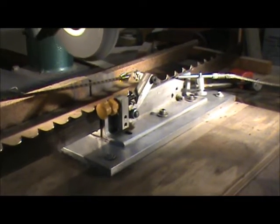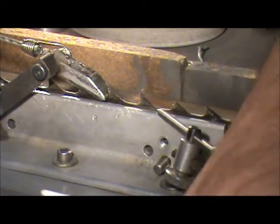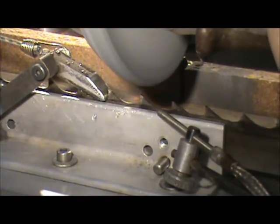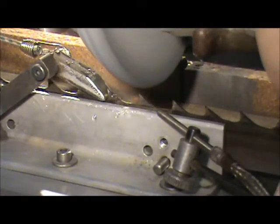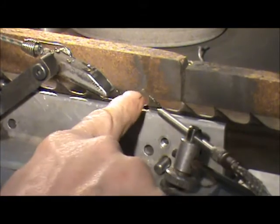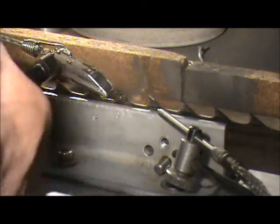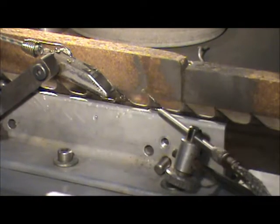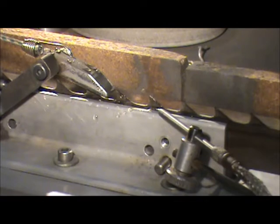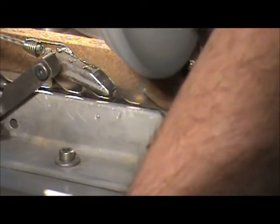Let me move the camera to give you a different angle. I want to get you a good view of the tooth going through — hopefully that's good. Steady pull it back, nice light grind. I'll readjust so I'm grinding the back of the tooth on another go-around; there's no sense demonstrating that separately — the same procedure, I just change the setting. About the Mystic Mist fluid: don't atomize oil or something you're going to be breathing — use the right stuff and it'll work well for you. It keeps the blade nicely cold.